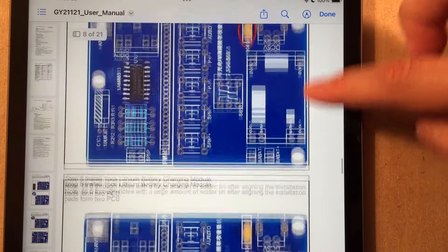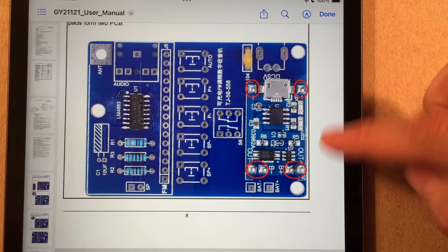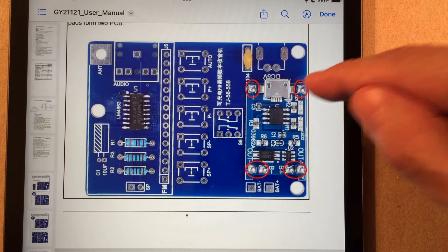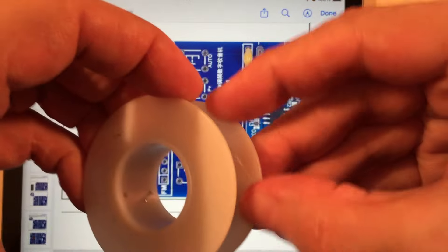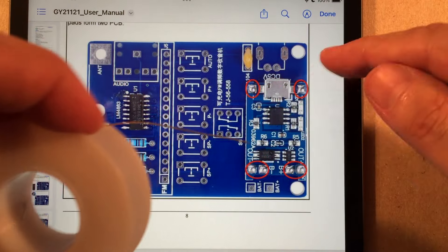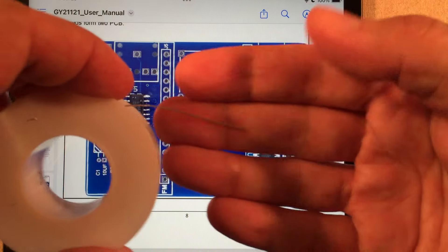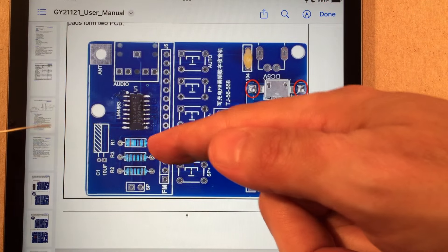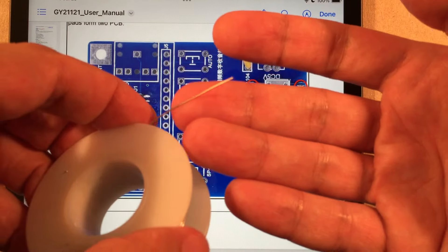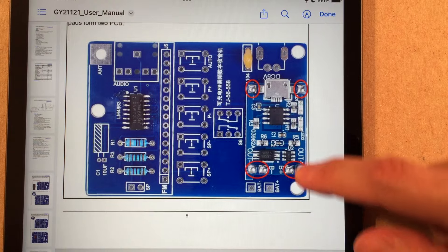You can see they're putting through-hole components in — resistors, capacitor. There's our charging board. Now they're showing it just filled with solder but I don't like this setup. I actually use bus wire — it's a hard electrical conductive wire — and I just put that through, solder it to the board and then solder it to the PCB. You could also use excess component legs, the ones you trim off from resistors. Save those little legs and use them as bus wire.